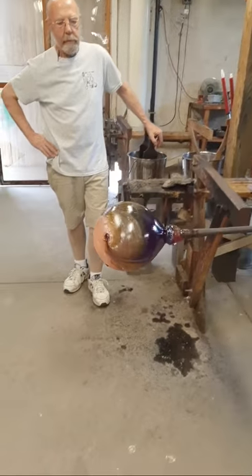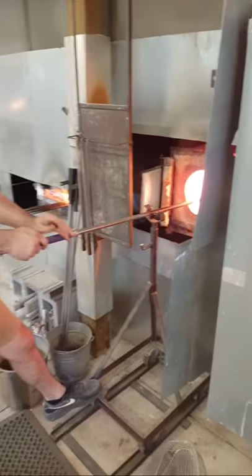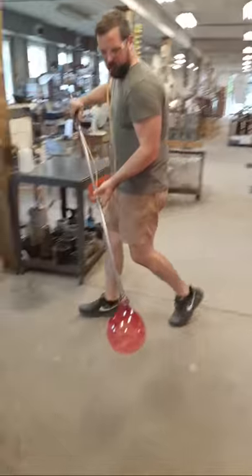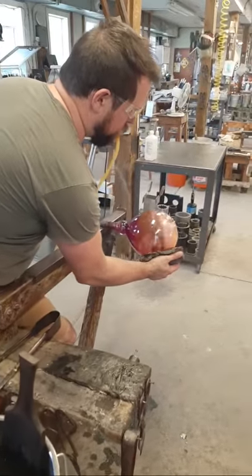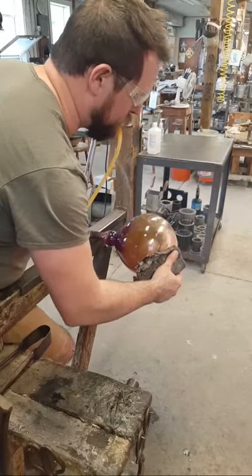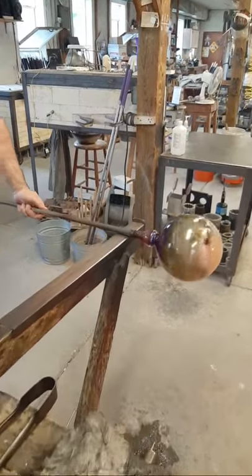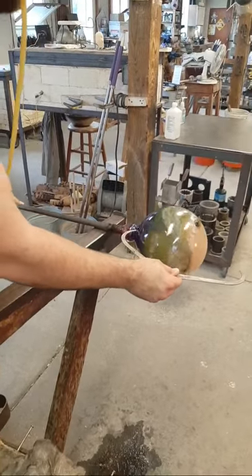You can see the blue pulled up through the green and into the white — quite a large sphere forming. He doesn't have his finished length set yet, so we blow a little larger than our finished diameter. When we lengthen the glass through centrifugal force or gravity, the diameter decreases, so we don't want to go below our finished product size. He's using newspaper — about seven or eight sheets of newsprint folded into roughly a seven-by-eight-inch square, always kept wet — to chill the bottom. It's a perfect insulator.